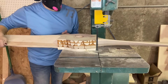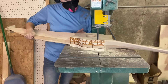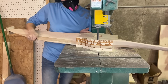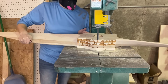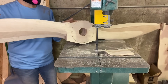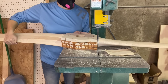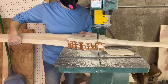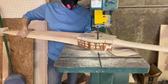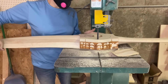The first thing I do on the bandsaw is cut off all the extra around the hub. I don't go inside the line — I always leave myself a little extra and I'll sand up to my line on the sander later on. At this stage I don't even try to get on the line, I try to stay just barely outside it. My blade was pretty dull in this video — it's one of those things where you say you'll change it right after but you never go back and do it.